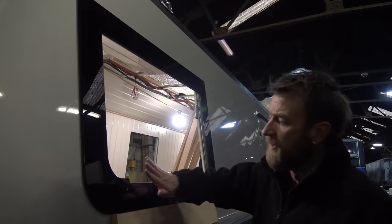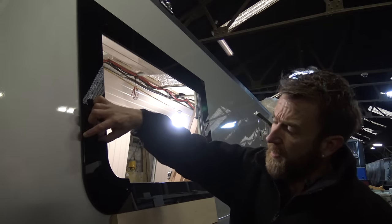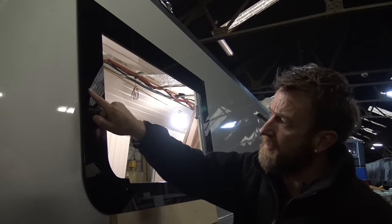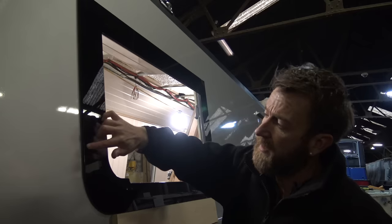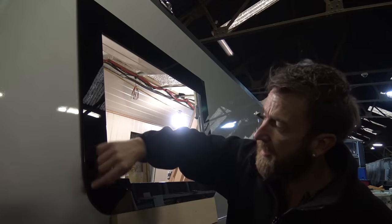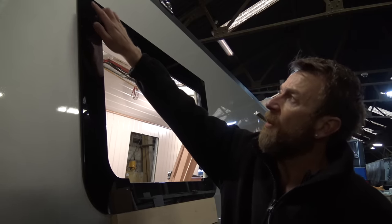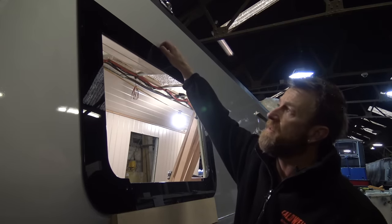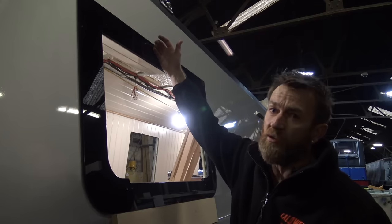Right, now we've sealed the windows to the boat, we have a surface area to work with. As you've seen when I was applying the sealant, it goes down the centre. When we press it down, it spreads out. In doing so, we won't get a clean finished edge around the side, so it will sort of sculpt its way round. What we don't want is water going into the edges and then freezing in winter, which could cause some damage.